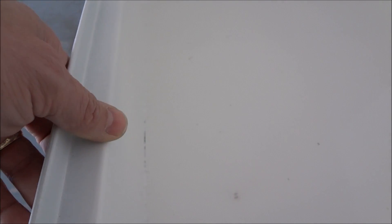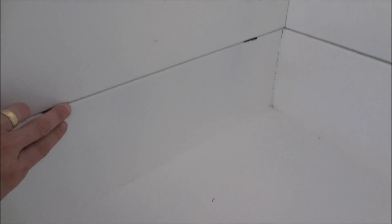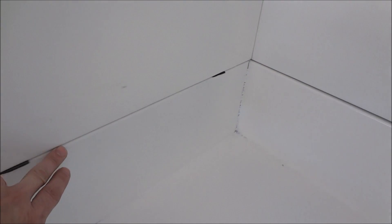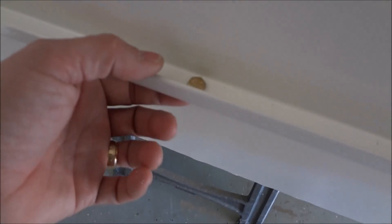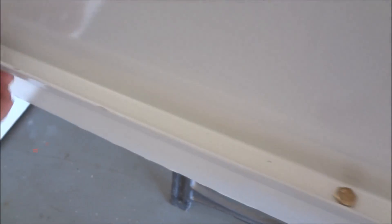The pan has a lip all the way around, which allows all the coolant to stay in. Anything splashed up on the walls will just drain down. Where the panels meet the pan, I took a piece of inner tube, cut a square rectangle, folded it in half, hole-punched it, and stuck the bolt through it to bolt it down — making a sort of gasket that seals everything. I'm using quarter-twenty bolts to bolt everything together.